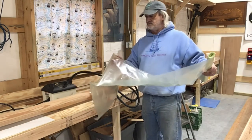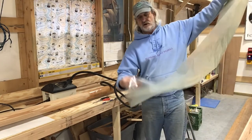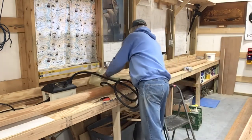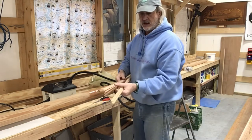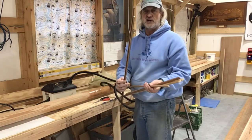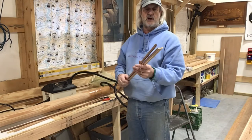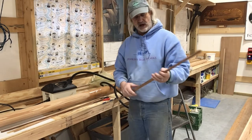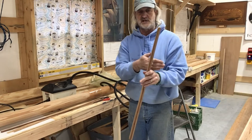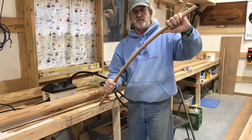I bought this plastic from some composite outfit, but you could use any kind of heavy-duty construction plastic. I like this because it's in a tube, so it's already all enclosed. I've got some strips cut — a couple are mahogany and one cedar. These are quarter inch thick. I need a total of three quarters on the stems, so I've got two mahogany for each end, then cedar on the very end, because the cedar will be a little easier to work. I'll need to bevel these once they're bent on. I can't bend them right now — I'd break them.